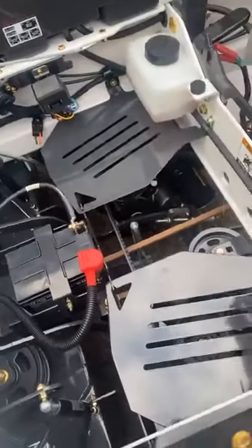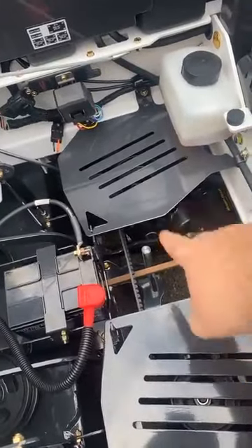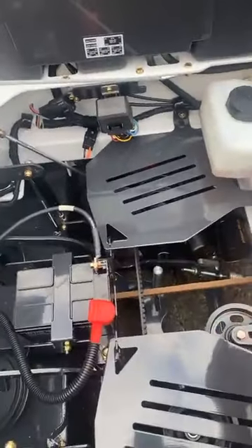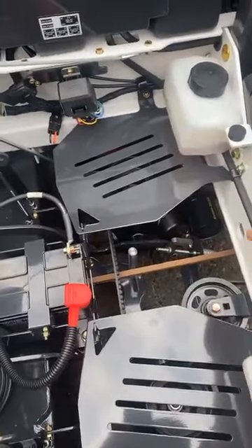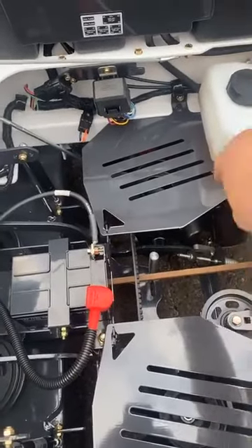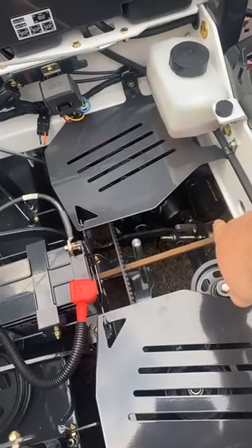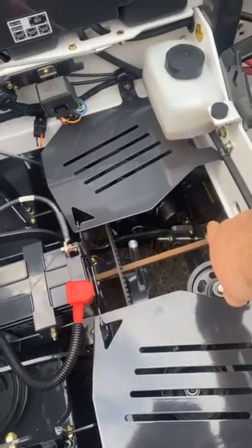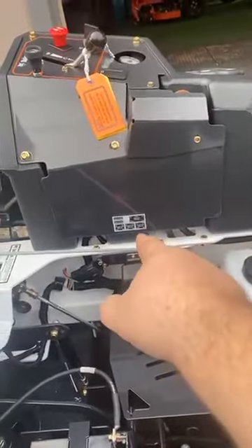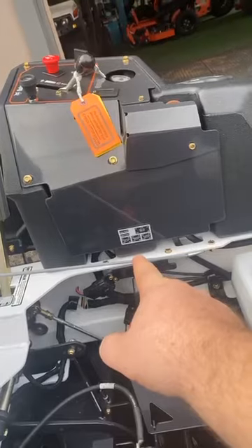There's your fuse box, hydro tanks — one on each side. It does have guards over top of your cooling fans, which I like — stops grass and debris from going into the fans. It is pretty open to get down to service your tensioner on the transmission, which I like. And right down there is your filter for your hydros, so it is serviceable. Also, the fuse box tells you what fuses go in each slot — no other brand does that, and that is awesome.